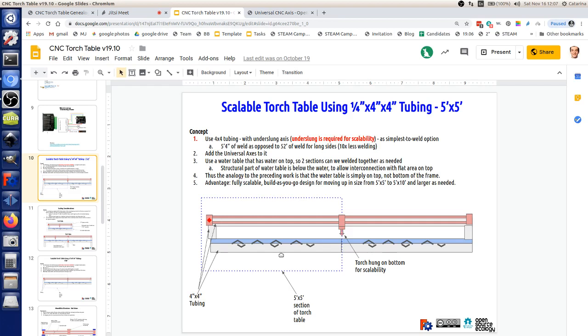A simple four-sided structure, no brace in the middle, is easy enough to hang the gantry on. Now the bed is where you need more strength — it's going to support the workpiece. Common use will be half-inch steel; making tractor parts, brick-press parts. But if you're building an ironworker machine, you're talking about 3-inch steel — 3-inch steel is going to be 1,800 pounds for a 4x4 sheet, so you're loading with a tractor.